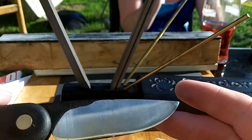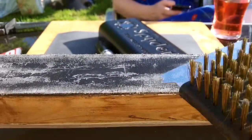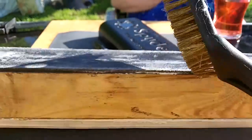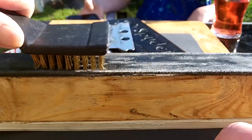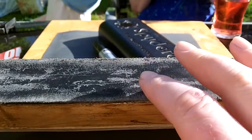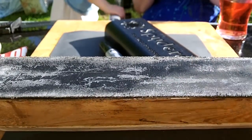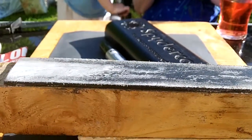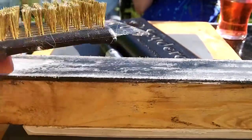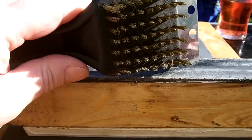Hopefully these tips will help you out when starting out in sharpening. When maintaining your strop after it's been used a while, it'll start going black. Use one of these phosphor bronze brushes — the kind for cleaning barbecues — and scrub the leather. Give it a good scouring to take off the old compound and bits of steel, and it'll raise the nap of the leather back to a furry suede finish. When you rub in new compound, it acts like a wick and holds it. Every so often when it goes black and shiny, scrape off the heavy stuff with a scraper, use the phosphor bronze brush to raise the nap, re-apply compound, and carry on.